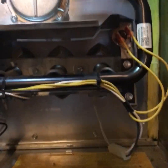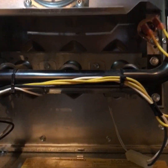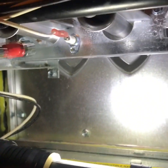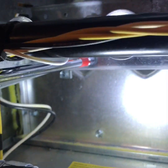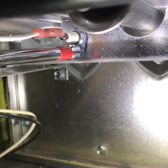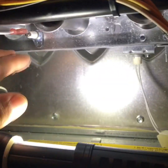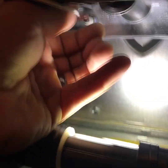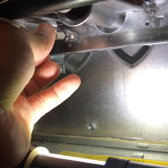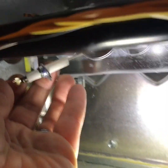You can take both the doors off — this is a Trane or American Standard. The flame sensor is right there, and you need a quarter-inch nut driver to remove it. A lot of times they're curved, so you need to twist it like that and then pull it out.